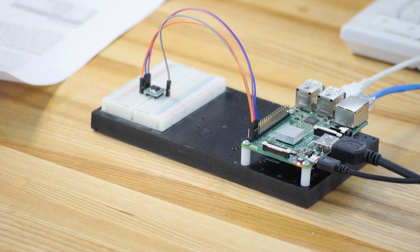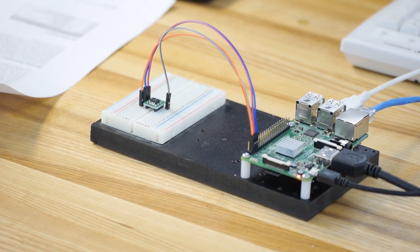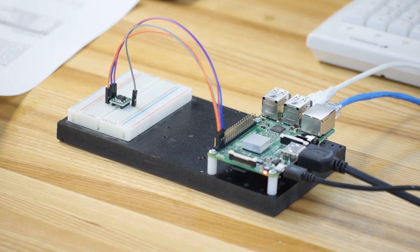Felix, that Oregon Trail game looks to have two different I2C EEPROMs on it. One is pretty standard. The other one's kind of weird. Yes, I'm very curious. The signals look like they're I2C. So I was thinking, why don't we try to dump them? And the fastest way to do that is with a Raspberry Pi. Hey, you know what? I got some. I got the Raspberry Pi hooked up to a little test circuit here, and I got some code. Let's try it out. Yeah, because there's I2C lines right here.